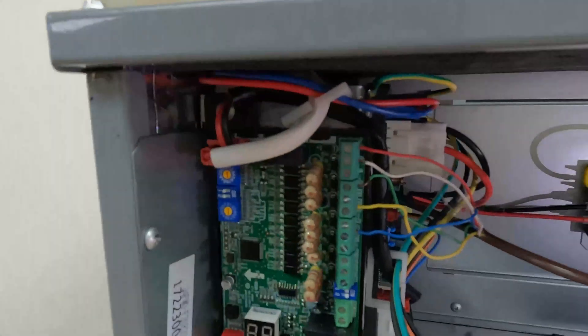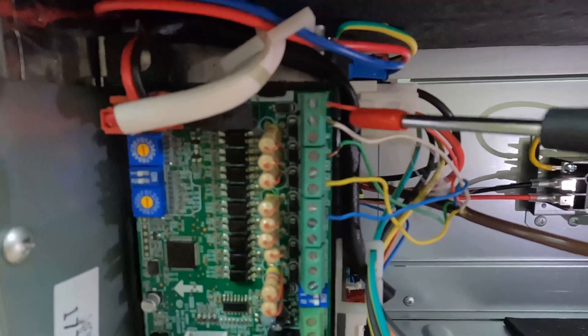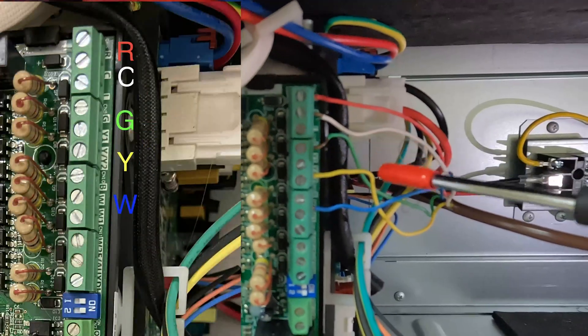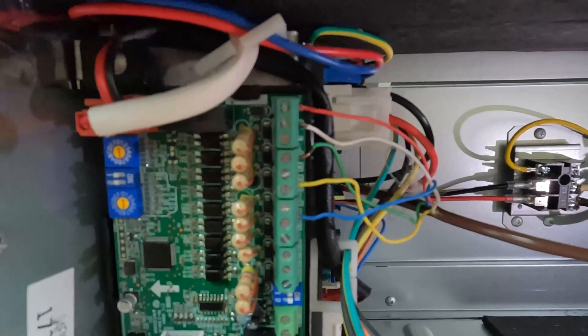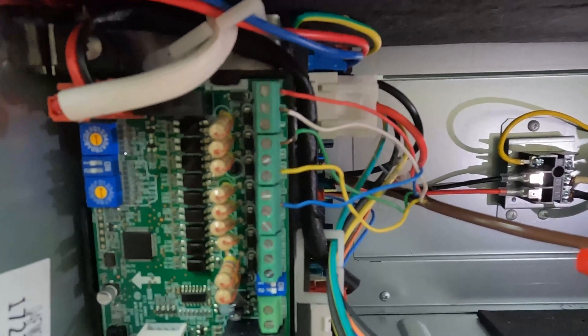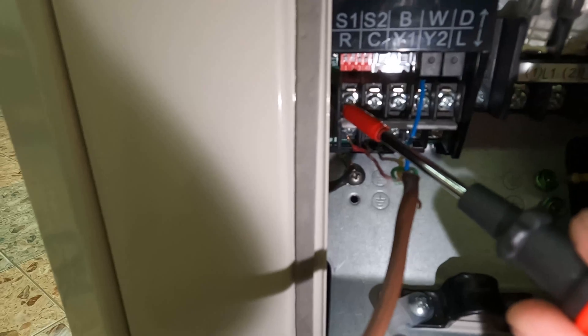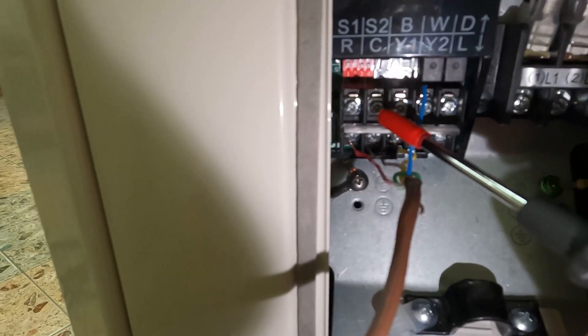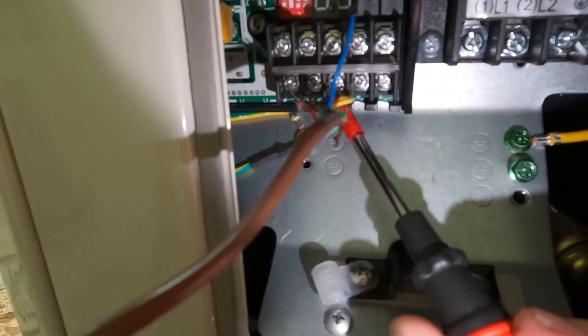We have disconnected the wired controller S485, and S1 and S2 are also disconnected. We're now going to give you some instructions on how to wire the 24-volt thermostat. We have red to R, white to common, green to G, yellow to Y, and blue to W. We're using blue to W in this case because we do have a heating strip. If you do not need any heating or furnace applications, you can disregard this. Remember, S1 and S2 are over here — no power should go there. Any power, including 24-volt power, can fry your board.